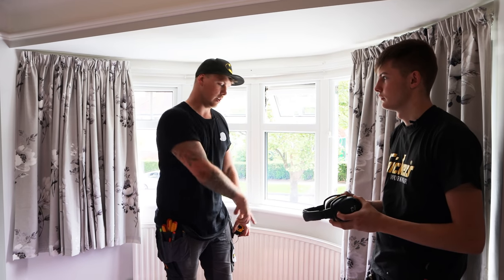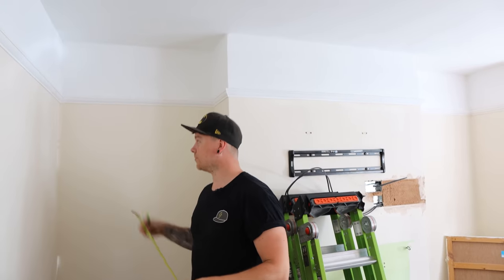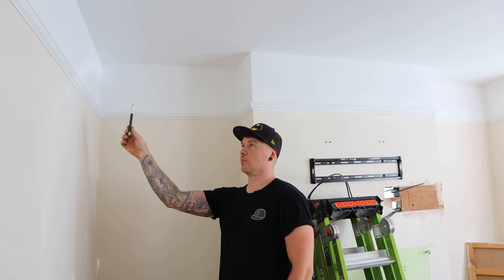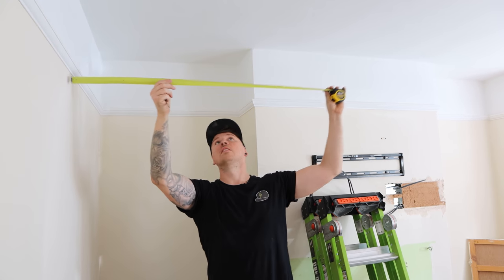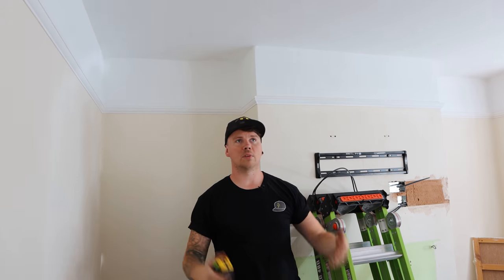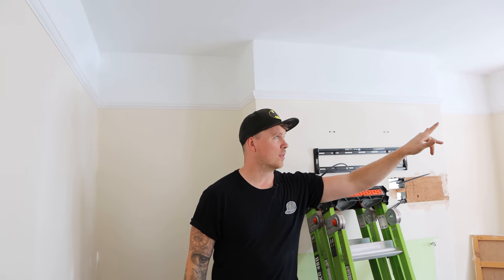And then the dimmer, there's going to be dual dimmers, a dimmer for the four lights and then a dimmer for the bay lights as well. I think what I might be doing is, the wardrobe comes out 600, there's a joist directly in front of the wardrobe. So if we go to the joist over, I think 800, which will land us about here. We do 800 square. So if we do 800 squares in each corner, it'll light the room towards the edges, bit of glow down on the walls rather than the central light. And then we can move over to the bay.